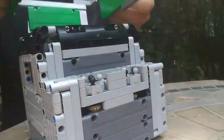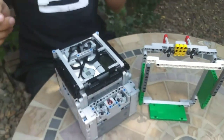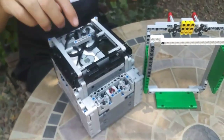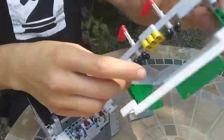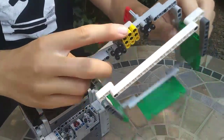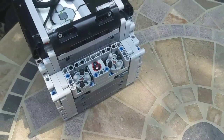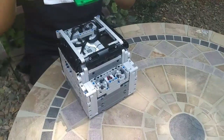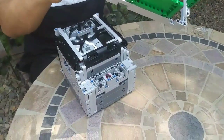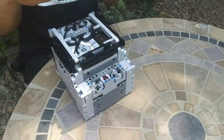The other thing that we do is that if you have a lot of programs on your robot, it might take a while to find which one you want to run. Each attachment has a little colored piece, and that gets detected by this color sensor, so it always knows which mission we want to run. It also knows that once it senses that this chip is there, it can stop spinning the motors because it knows that the attachment gears have meshed.